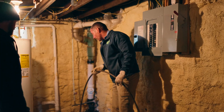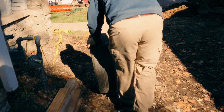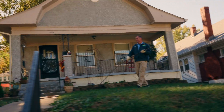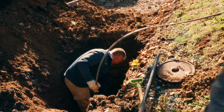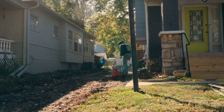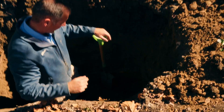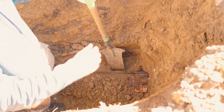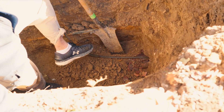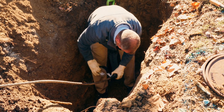The Christmas ornament just shattered in there, and we were dealing with the exact same thing we had before. Right now, we are running a sewer machine, a drain auger, out from the inside. We're going to be able to attach the pipe bursting cable to the drain auger cable and then pull the pipe bursting cable into position.